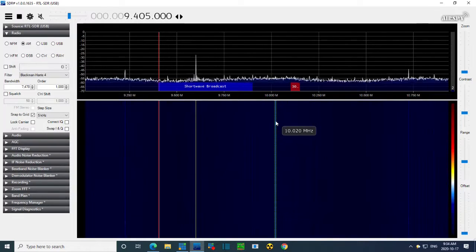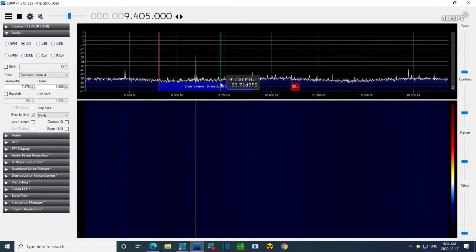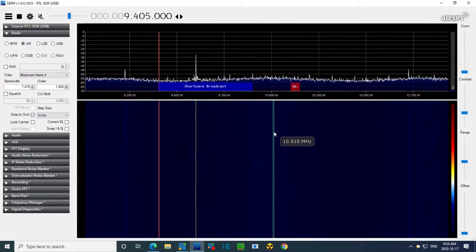So we're ready now to flip on the radio. I'm going to let you stare at this. I'm expecting another tall signal similar to this one to appear. The radio dial setting is 9.5. So theoretically, with an IF of 455, it should be 9955, which would be way up around here. So watch for something appearing here when I flip on the radio.